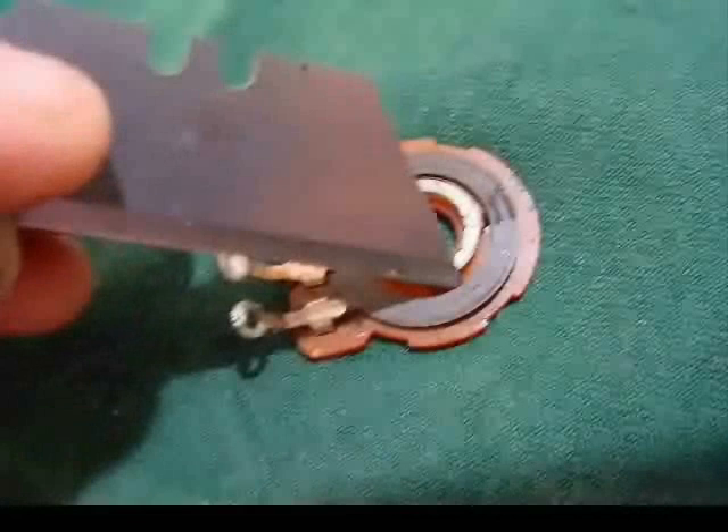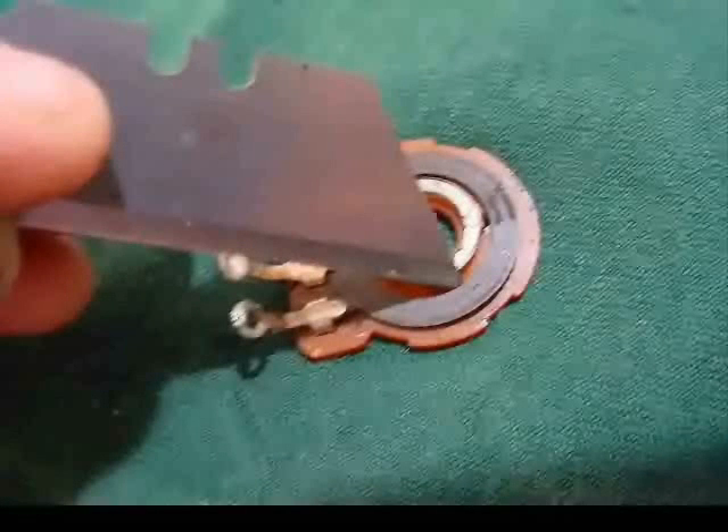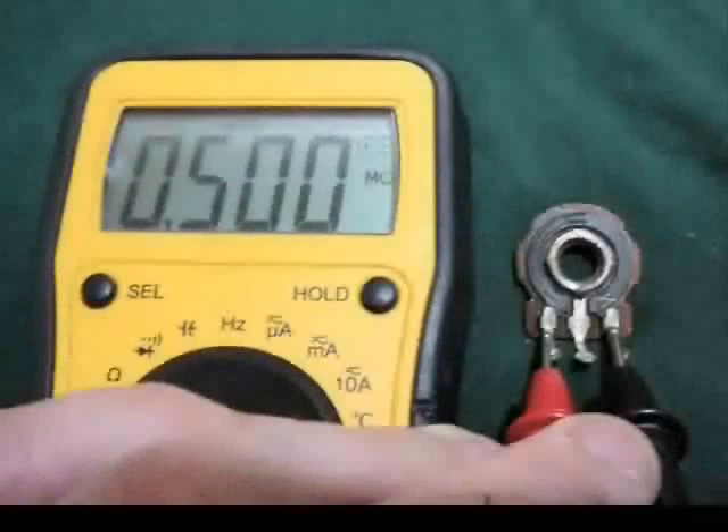However, I'm going to go with the inside track this time. Same rules — I'm going to scrape around the inside of the track with the edge of the razor blade barely angled to touch the track, and remove a fine bit of carbon around the inside. Having done that, we'll hook the leads of the multimeter up again. And what do we get? 500K.